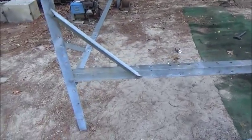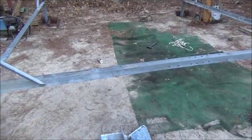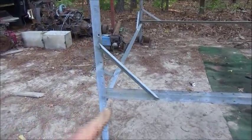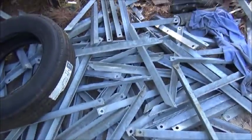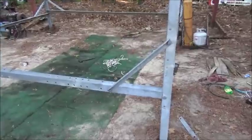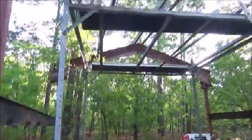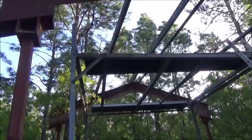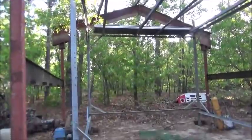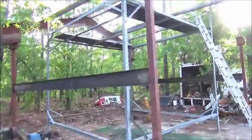We've got a mess here where we've been working. I was able to put the corner bracing on top and bottom and just hurried up and bolted it back together. We used every one of the 14-foot pieces and some of the small ones, but I've still got a pile of small stuff and a bucket of bolts left. The plan is, once I get finished up top, get our Z-braces on and the tin on, I'm going to take this scaffolding out and put it as a lean-to 14-foot out beside the building — so that's actually going to be another building.